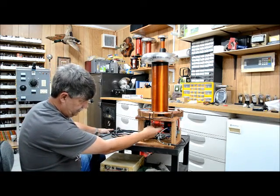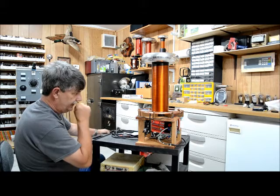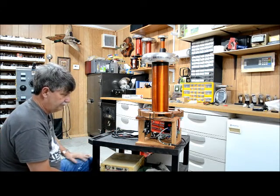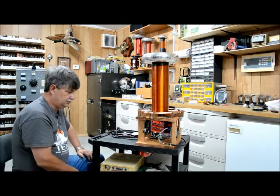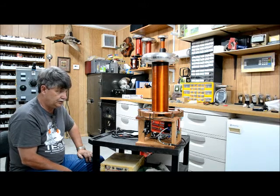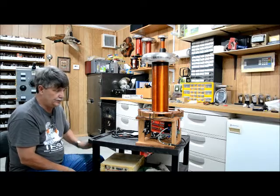This particular coil uses secondary feedback, not primary feedback. This is your secondary feedback right here — there's about 50 to 60 turns of wire on that, which goes to the ground wire underneath coming off your secondary. You do not use a breakout point with this thing; it strictly breaks out to itself. On this one I can get probably 18 to close to 20 inch arcs.